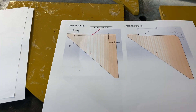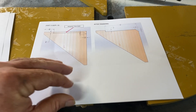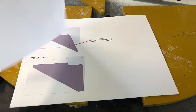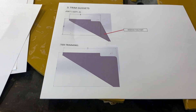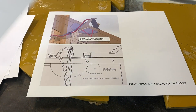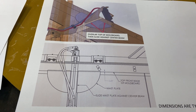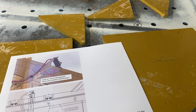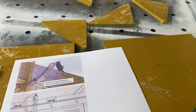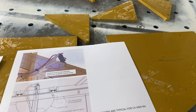It looks like we're going to take the corner off of it — that's the piece that goes up in that mold board. And then the other gusset, we've got to take a good bit more off of that. So I think what we'll do is start scribing some lines on these and get them ready. I don't know if I'm going to cut them with a bandsaw or just take the torch and cut them off. Let me get things ready and we'll do some layout.